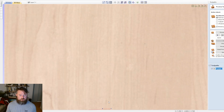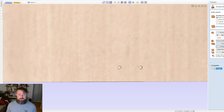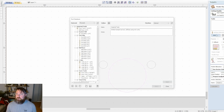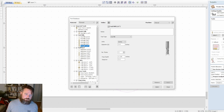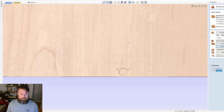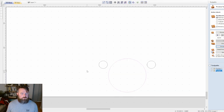Preview visible — you can see the quarter-inch bit is doing exactly what we want for the two small holes. Now for the bigger circle: we'll pocket that out too, but we'll use a half-inch end mill since it's faster. Hit Calculate, then preview, and it looks good.